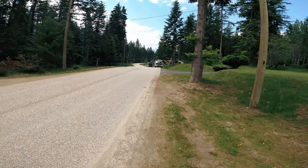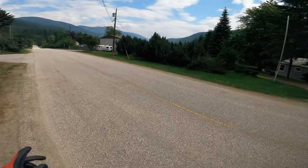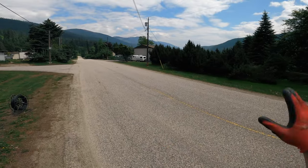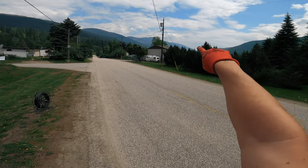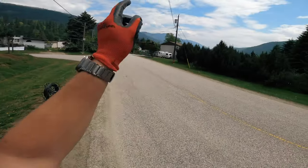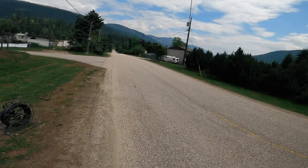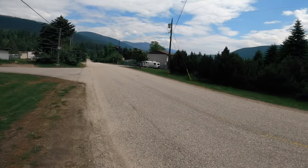Today we have about a 130 meter drop going to that house over there. Those are four units. I've already run a drop for units one and two. Now I'm running another double for units three and four. So it's going off this pole and then kind of just veers off. There's no strand past this pole.